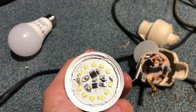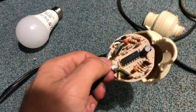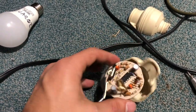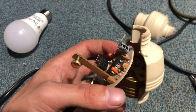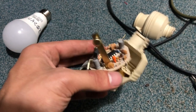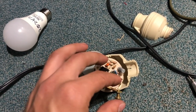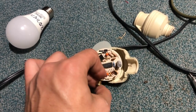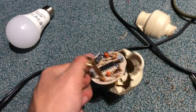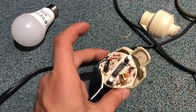I mean, yeah, you can take the globe off, but that's more of a user thing. But for stuff like phone chargers and little fatty gizmos that turn lamps into touch lamps, where there are electrical connections that someone can touch — you very much want it to be galvanically isolated from the mains. This is not galvanically isolated.